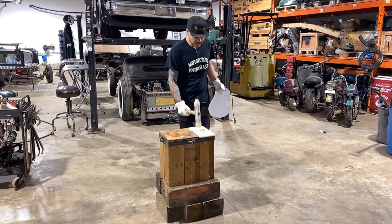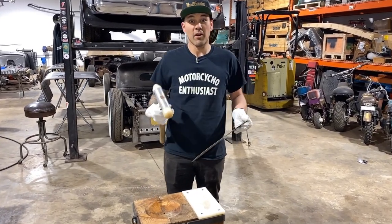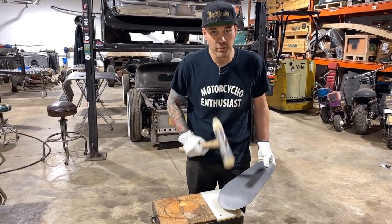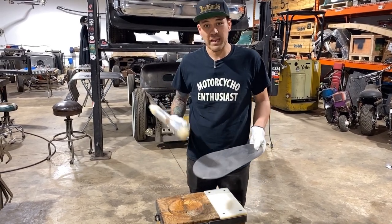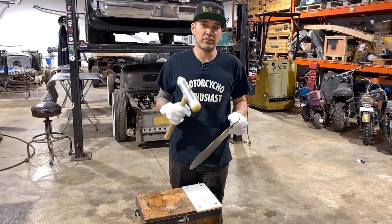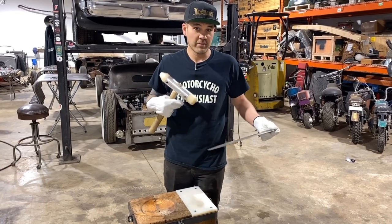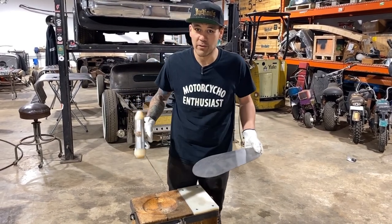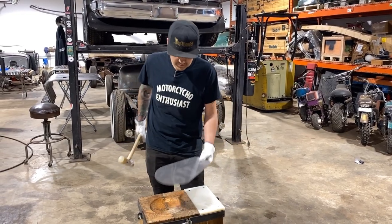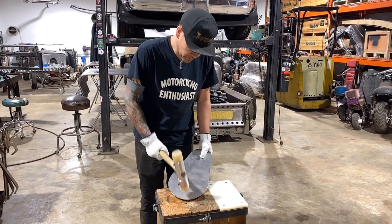I've put plastic here so we can smack out the finer wrinkles — when a wrinkle gets smaller and sharper it becomes really hard and could damage the stump. That's why the plastic is here: so we can planish out those wrinkles once we get as far as we can with the soft nylon mallet. Then I'm going to do some hand planishing with a cheap mushroom dolly from Princess Auto or Harbor Freight, just to show how nice a shape you can get with only hand tools — no power tools, no big expensive equipment.